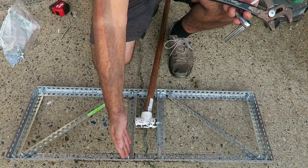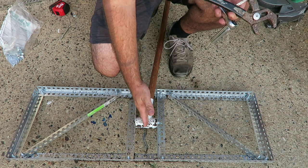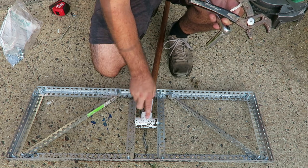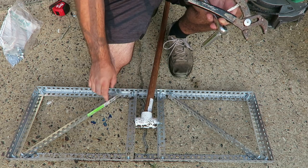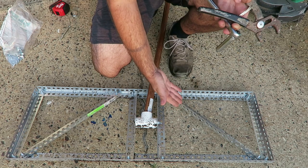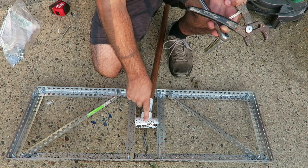The last step is lining up your two middle 12-inch pieces. Find the middle of the 36-inch piece — right at 18 inches — and put the T right there. Put these two plates flush to the T on both sides, then screw them in. The 16-inch piece can basically go wherever you feel is strongest — it doesn't have to be perfect, it's more just for strengthening the rectangle. I'll take this off and give you a closer look at how I did this.